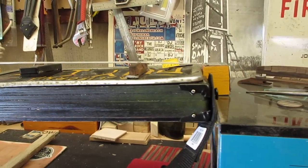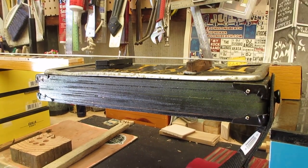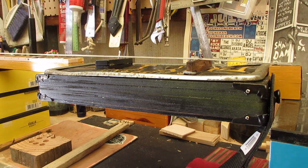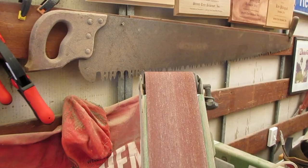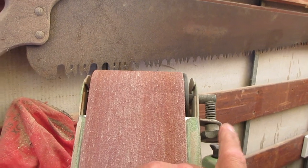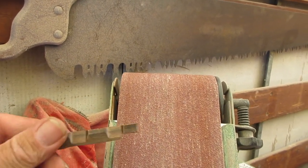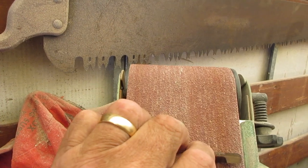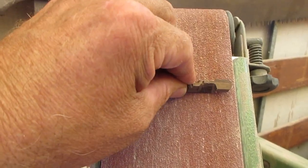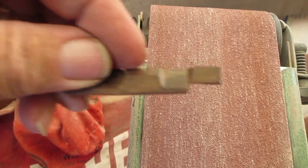Let me move this - it's on an old something-or-other here, looks like it used to be a chair at one time. We're gonna take it off of there. Now there's two ways to do this - you can either do it on a belt sander. One way is on this belt sander - I can adjust this while it's running and move the belt this way or that way. I can take the piece of my floating bridge and ride it right there on the belt, flip it around, and do that. This is a quick way to peel your fingernails back if you don't watch it, but it's a quick way to take a lot of material off.